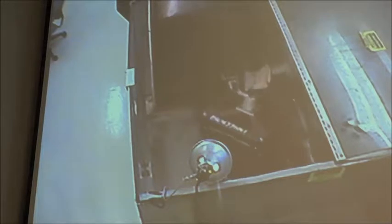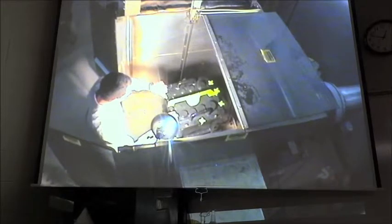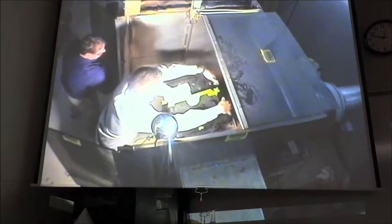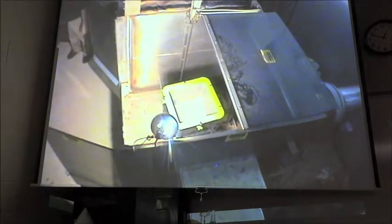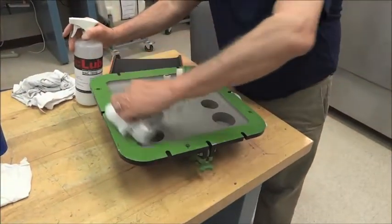In this case, it is recommended to run a dry cycle. We've closed the mold, put it into the oven, and will run a quick cycle. We like to see mold temperatures between 250 and 350°F for about five minutes. This allows proper curing of the mold release, which should give you the greatest durability and the most resistance to abrasion. Now that the product has been cured, we'll remove the top, target a few trouble areas like the holes and parting lines, and then we're ready to mold.